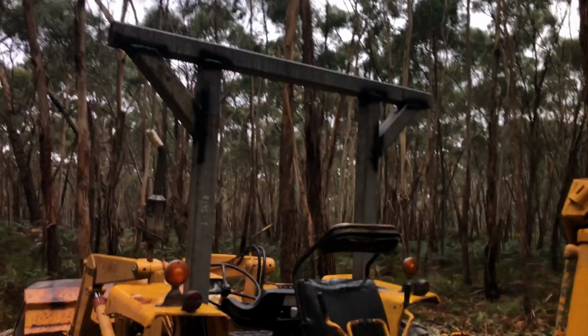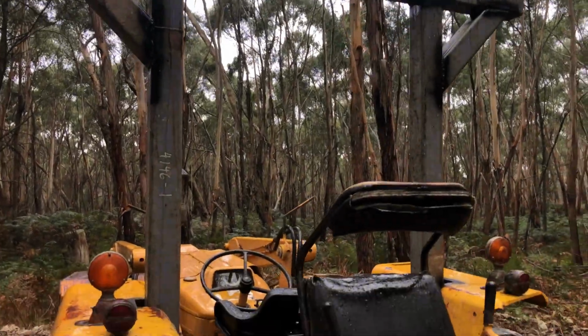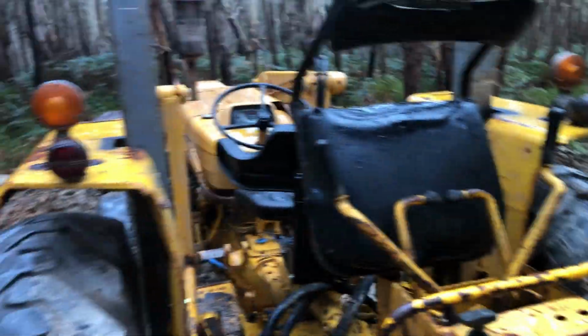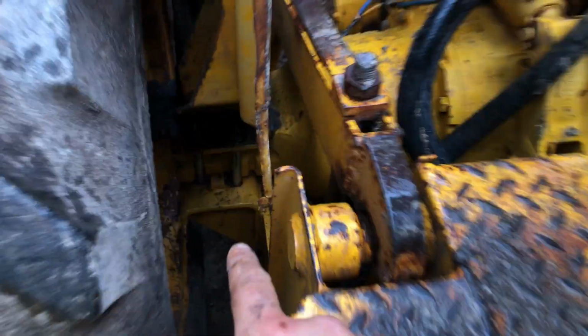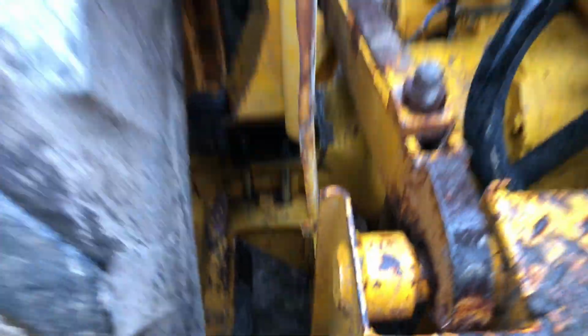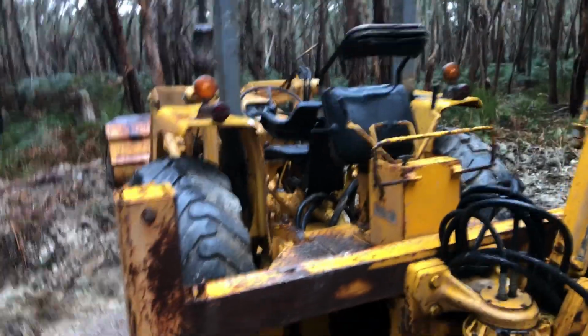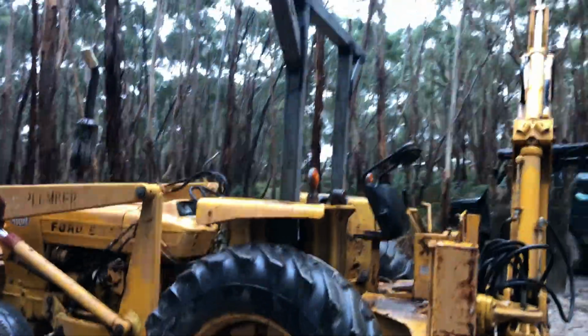It's only been 2 weekends and we've got the ROPS designed and built and installed. We've had the mudguards modified and reinstalled as well. We've got a brand new seat. We've replaced all the bolts on the square axle as well, so we know they're up to the task if we do have a tip. Yeah, it is well worth doing, and to be honest, for 2 weekends worth of work, that is pretty good.